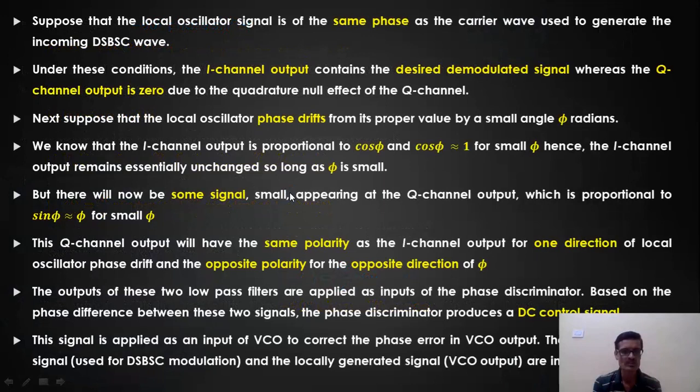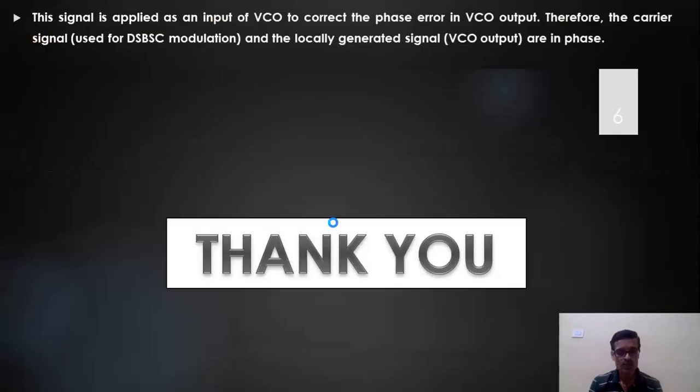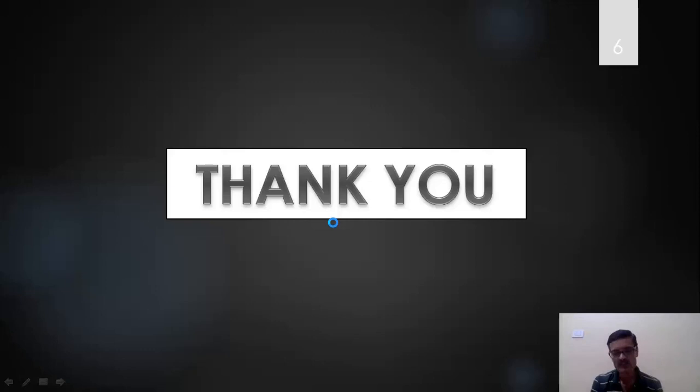The same concept I have explained over here by using these lines. The polarity will be different for different directions, and the polarity will be the same for the same direction. So this is about the Costas receiver, which is used to demodulate the DSB-SC signal as well as to control any phase variation.